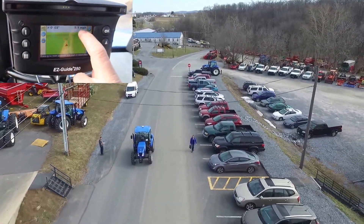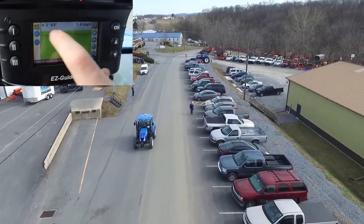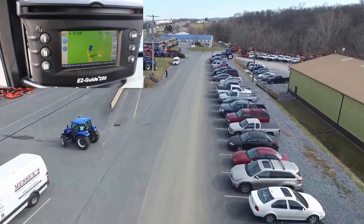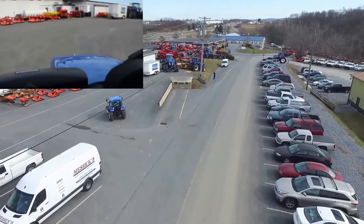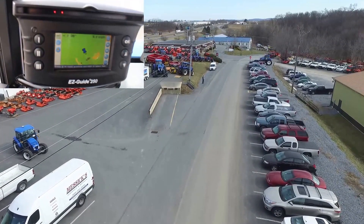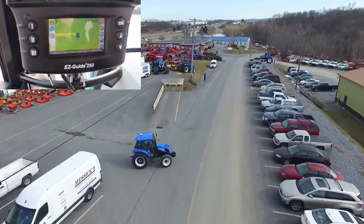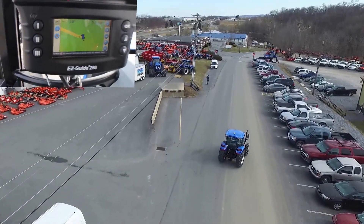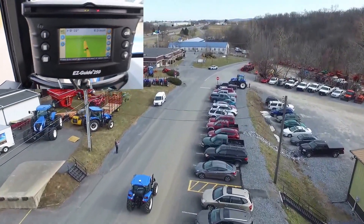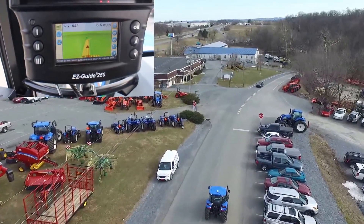The other nice features are in the top right corner you have speed, and over here it tells you where you are relative to the line you're driving. I'm a little bit off my line, but it gives you a good bit of information. You can also see the tractor on the screen is switching as it comes to the headland — it knows where you stopped your guidance line. So it gives you an overhead view when you're turning around, which makes it easier to see your next line, especially when you have a small implement. It gives you a nice view of the implement behind you while you're turning over to your next line. Then it switches to more of a horizontal view with that red triangle, so you can see down in front of you where you're headed on the screen while you're driving down the swath.